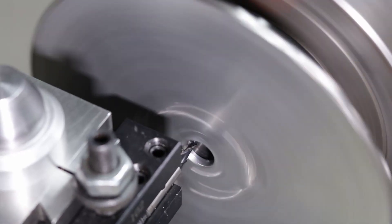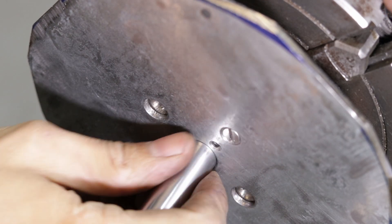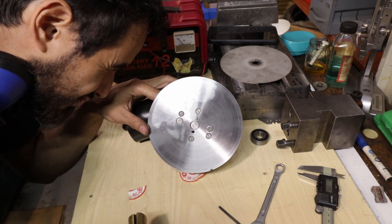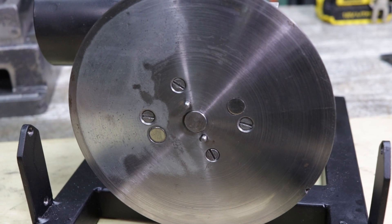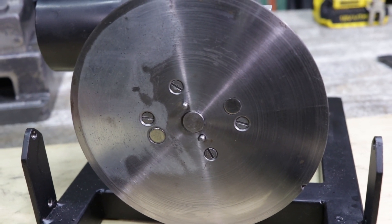There's that little boring bar being used again, and a nice snug fit. The next step is to hammer in the drive pins and seat the magnets, and we have a nice little quick-change drive mechanism. Maybe I should have used aluminum though, as this plate wasn't quite straight enough. It's not pretty, but it'll work.